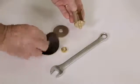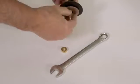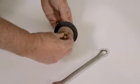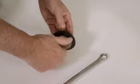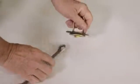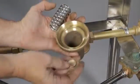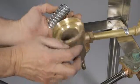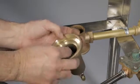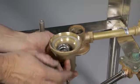Reassemble the regulator yoke, regulator washer, pressure plate, and 7/16 inch hex nut. Install the pressure plate with the beveled side towards the diaphragm so it does not cut the diaphragm. Tighten firmly — do not over tighten. Place the regulator spring button and spring into the spring chamber. Check that the button is aligned correctly on the regulator adjusting screw 686J. Be sure to install a new diaphragm washer around the spring chamber.